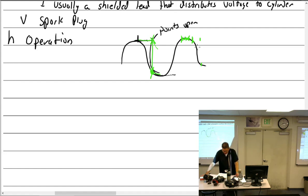All right, so let's see. The current that is established creates its own field that is opposite to the applied field. Said that. When flux is building, counter EMF opposes the buildup. I said that. When flux is decreasing, the counter EMF opposes a drop. So that's what I said there. When the static flux curve is decreasing, the counter EMF opposes it. Well, now that you're here, don't leave. When a coil is added, the static flux curve, the AC curve, looks like what I just drew.